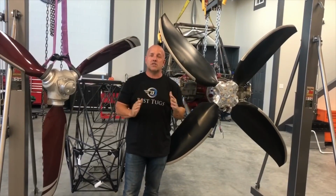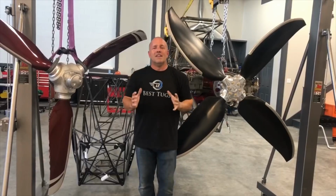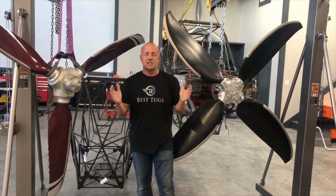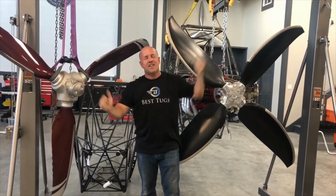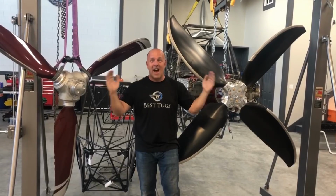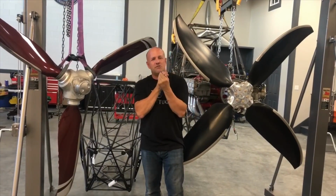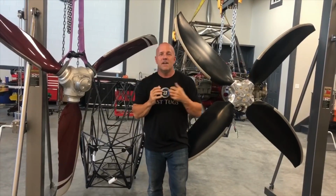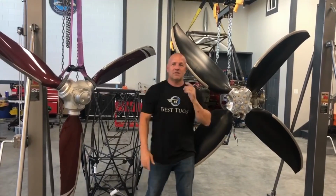It's just helping. So I'm using a smaller diameter prop, a much bigger paddle, and I'm gonna super exaggerate to give you an understanding of how much that helps. If I have a long prop, that leverage really can turn it. If you go super small, let's say like a jet engine, I'm going hyper the other direction, you shrink those blades up smaller and smaller, you just get a needle blast, and that has almost no rotational forces on the aircraft. So small diameter, big blades so it doesn't cavitate.